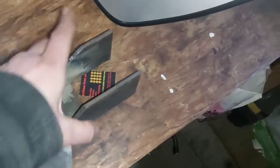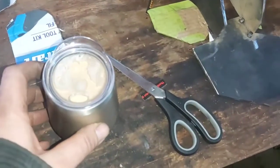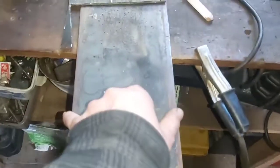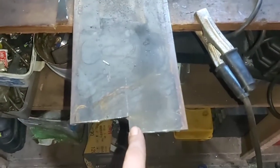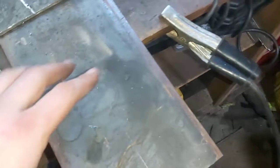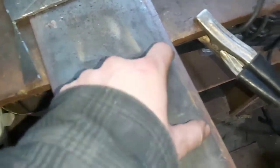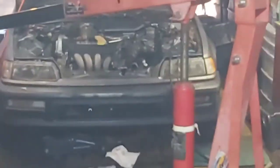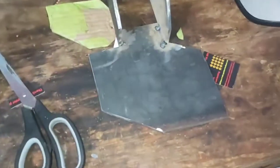You've got to get your coffee and scissors. I'm using six-inch plate steel — sorry, three-sixteenths of an inch thick by six inches wide — and that seems to be the perfect size, especially for the transmission mount side. That's basically the height you need right there; it's just on a little bit of an angle. Got the grinder, the welder, some drills, and that's where we're at.